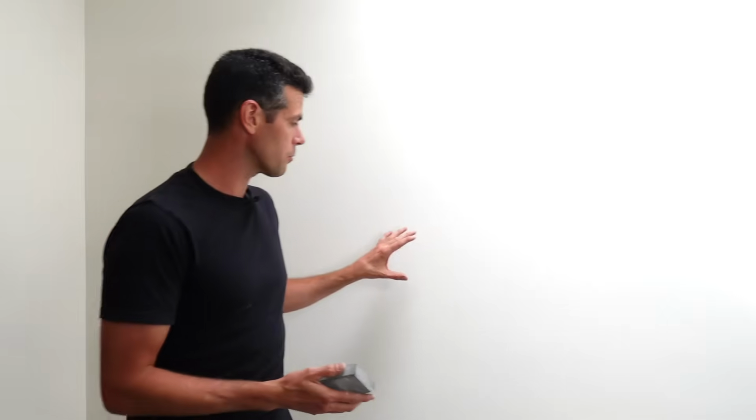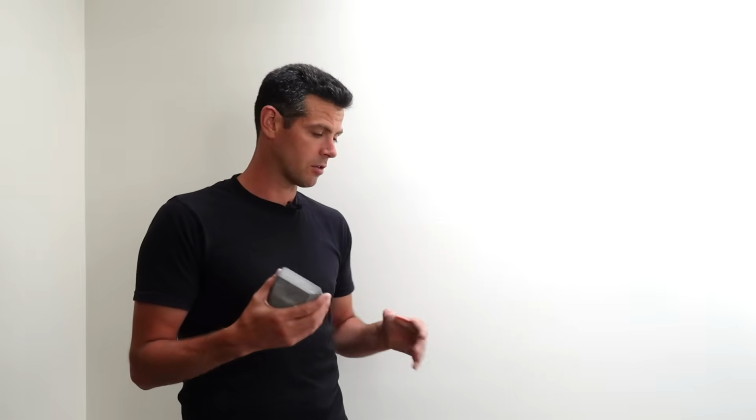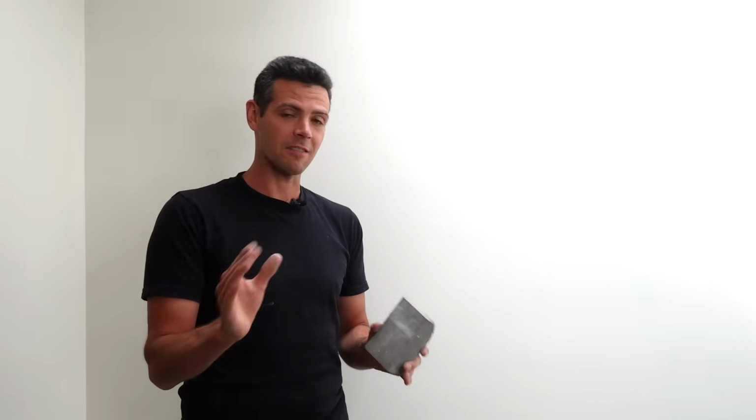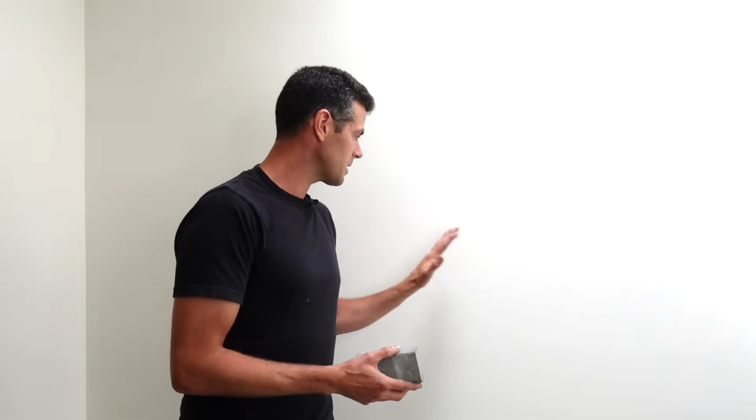So one of the reasons it's not really bad is I'm using the exact same mud. It's actually the same mix, so it's the same consistency. If, say, your touch-up mud is thicker, or it's a different type of mud, so this is topping, and I'm also doing my touch-up with topping, but let's say you did your final coat with topping, but then you did your touch-ups with all-purpose, or even worse, some sort of painter's spackle. That's the biggest no-no you can do, is to take painter's spackle, because it's way harder to sand than drywall mud. So if you're touching up with that sort of stuff, it's gonna be a nightmare. It's literally gonna leave islands on your wall where all your touch-ups are. But again, I'm not really struggling here because I'm using both of the same types of muds.